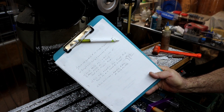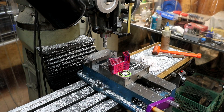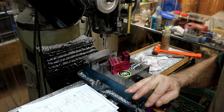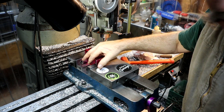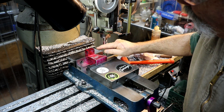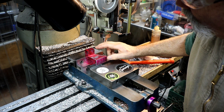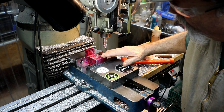Write down the steps and the plan — dimensions and all that good stuff. Having a drawing is one thing, but writing it down can really help with your operations and make it go a lot quicker. I have the part sitting up on top of two half-inch parallels and this side against the fixed jaw. I have about 40 to 50 thousandths to take off this surface, and it has to extend back into where the stanchion is. I'll rough some of this out first, get it all down to the same depth, then do the finish cuts.